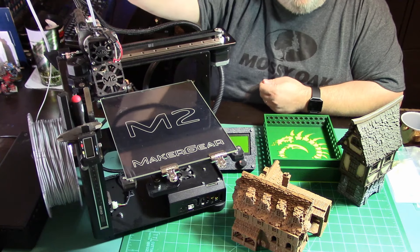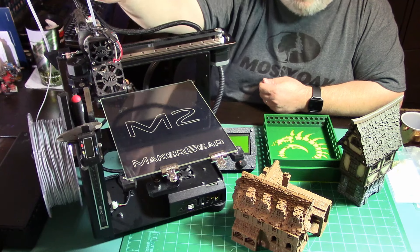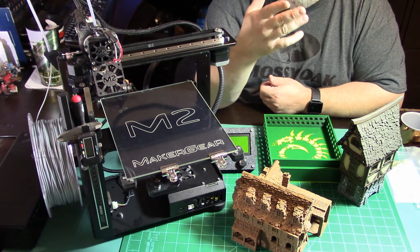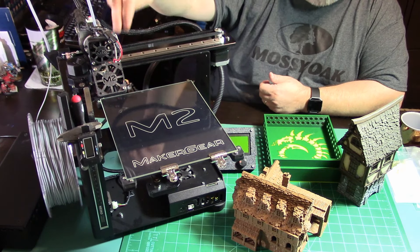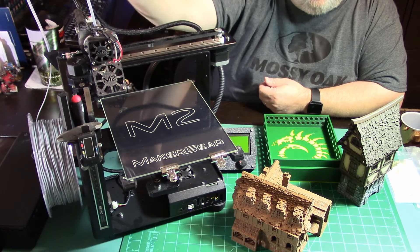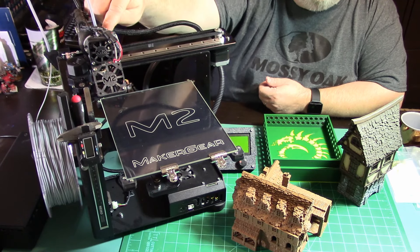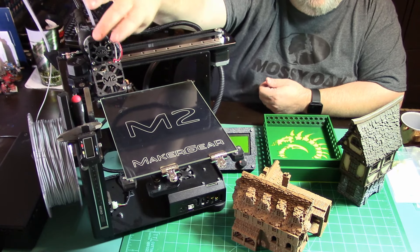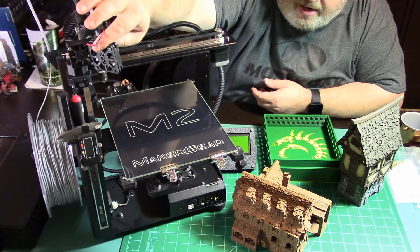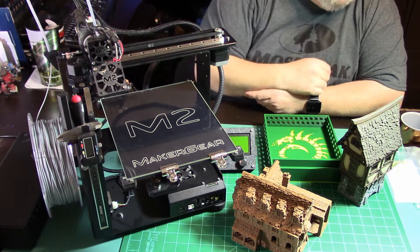I would highly recommend if you're buying the printer, buy yourself an extra fan just in case. You're going to get excited, pull this out while it's still spinning from a print job you just finished, let it go, and you'll be shocked that it will perfectly bounce right into your fan blades. Since then I've added a piece of G-code in my ending script in Simplify 3D so when my print job stops this cooling fan immediately stops. This little fan comes on at 50 degrees Celsius and turns off at 50 degrees Celsius on the print head.